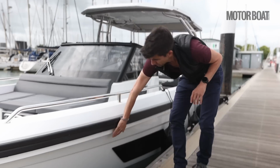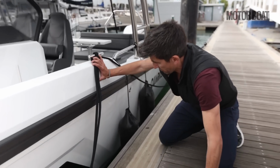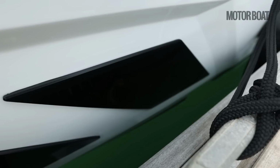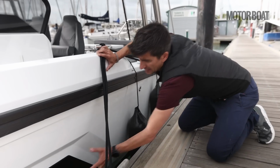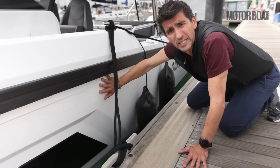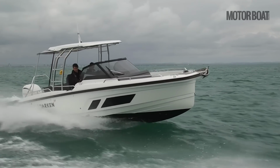Now as you move back, that flare gives way to a thick rubbing strake that takes on the job of splash deflection. And we move back here to where you see another vital accessory of this particular sector, which is twin hull steps. Again, they look magnificent, and they're designed to introduce a little bit of air to those planing surfaces just to free up the hull, get extra revs, a bit of extra pace, extra running efficiency. But what I really love here is this section. What we have forward there is a window. This is not a window at all. This is a stylistic device, and it kind of looks a little like a Windy Coho 29, which in itself is a gorgeous and very seductive boat. And it picks up the perfect angle of the hull step just below, so it looks superb. It's optional, but it's certainly an option I would look to take.